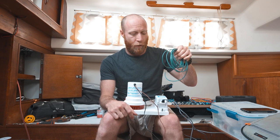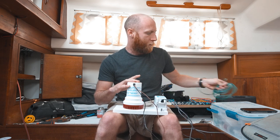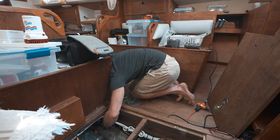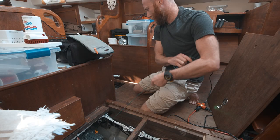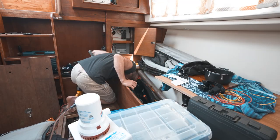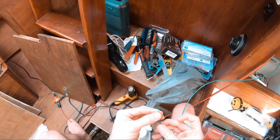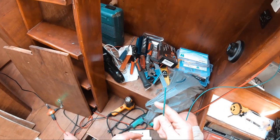It's been a long winter — our vlog has basically become a chronicle of Chris's beard. It is day two. I had to pause yesterday because I wanted to get some different colored wire to differentiate the automatic positive from the manual bilge pump positive. Here we have the final wire I need to attach to the switch, which is for automatic — being the float switch. So I'm going to do the final test.